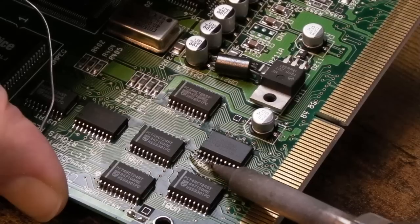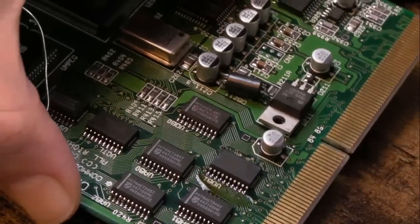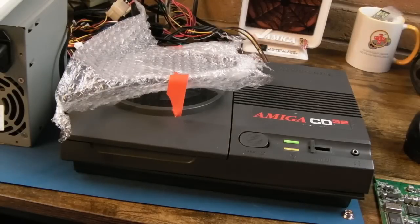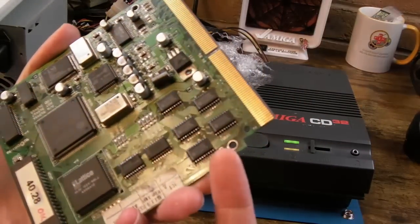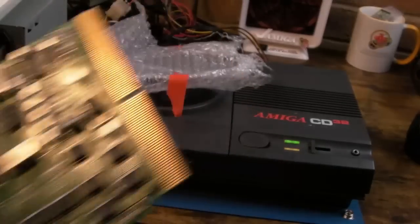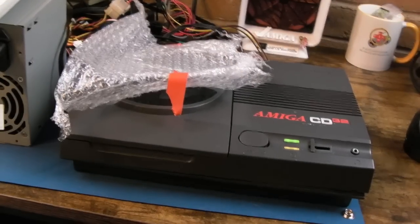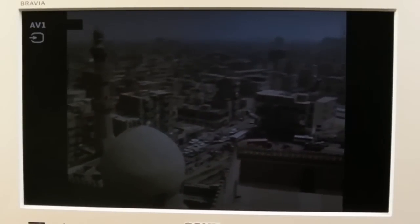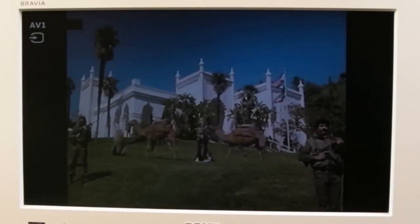That's one side done - I don't see any bridges. Oh my god, there we go! Follow your hunches - we swapped two buffer chips on the data bus on the other board, and it's working! We obviously still have the squeaky clicky audio because I fitted that dodgy audio chip on that one, but the good news is both cards work.